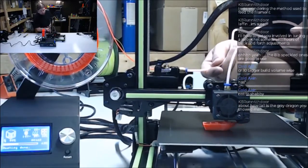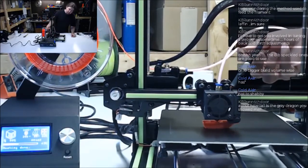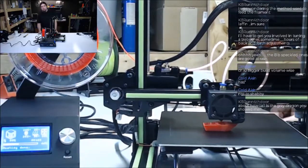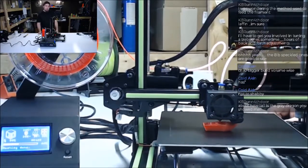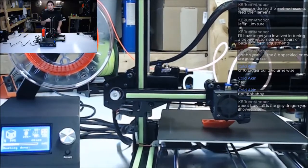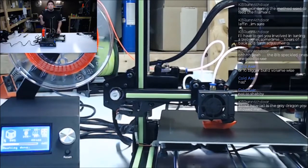It is definitely grinding more. It probably dipped real low, but it hasn't come back up to 205 yet. Let's see what it does. I don't know how far we want to get into that, but there's PID tuning, and I cannot remember what that stands for. But PID, they set that in the software so that when a temperature changes, instead of just turning the power on and off to the heater, it'll pulse the power at a certain rate. So you can tune the PID at how fast it pulses and for how long.